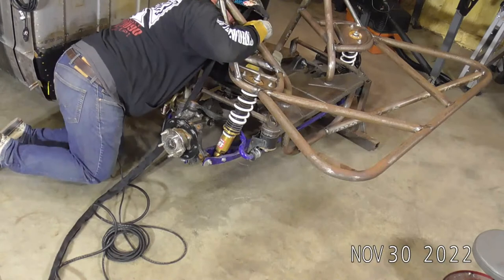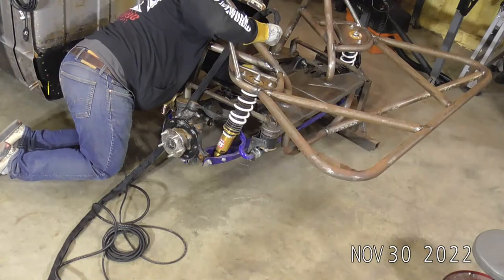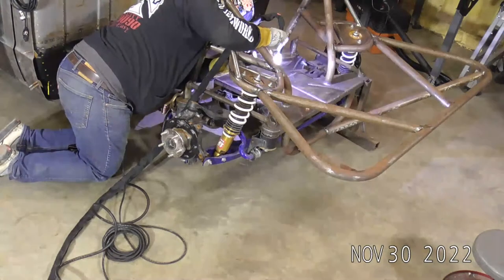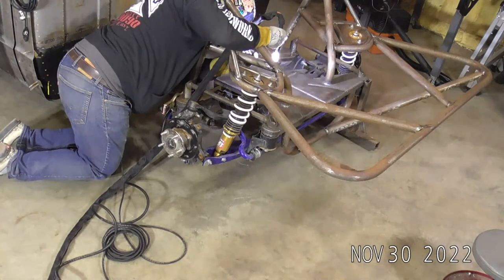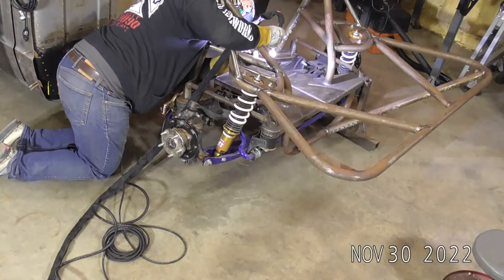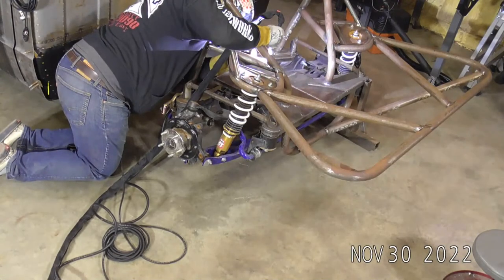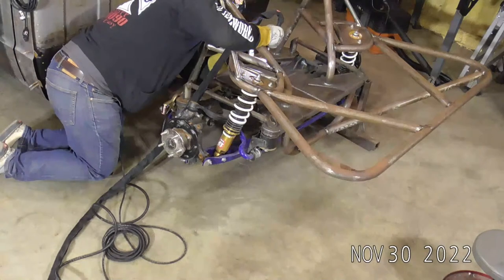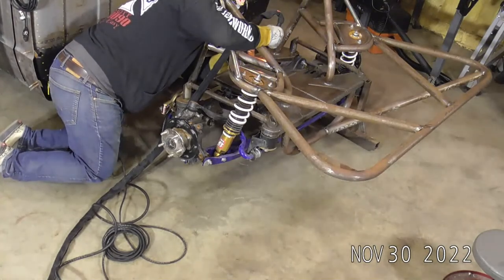The other thing that's fun about doing stuff like this is deciding how you're going to hold the torch to get that proper angle. I'm actually going to run this into that joint. So I'm going to come on this backside. I get a real good torch angle this way. And this is where running a big gas lens cup really comes in handy doing chassis work. So you get a real tight corner like this, real tight joint. You can run a whole lot of stick out and still have really good gas coverage.